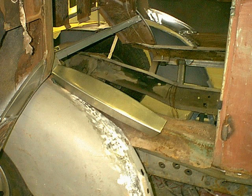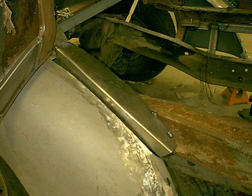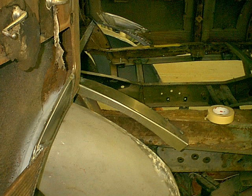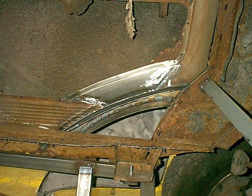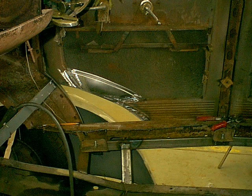I'm going to have to do some trimming on the fender — the fender will actually go up underneath this and bolt to it. Here's the first fitting of it, making sure how it's going in okay. Close the door — it's going to clear. I've got some paint clearance. I'm going to have to build an inner structure and fill all this in. Here's a panel that will go up inside to finish boxing that all in, so my fender has something to bolt to.